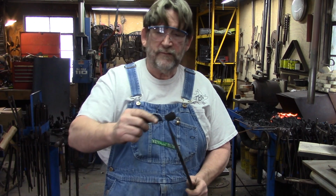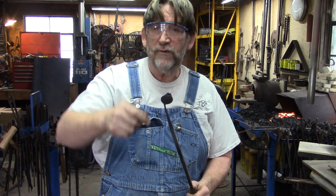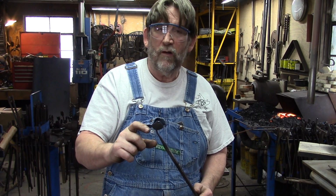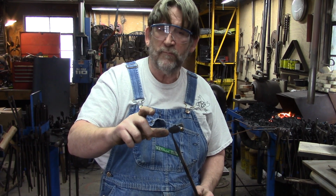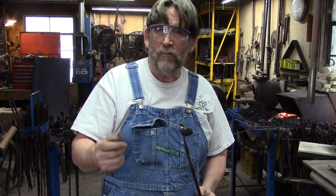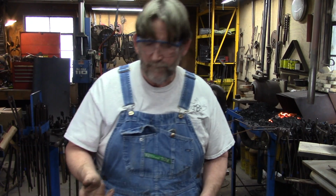Now you can take that and cut that off and then taper that stem, and you can make it into a curlicue for a keychain. A good demo for me and the public is to make about three of these. I leave the stem fairly long and try to cut them so one stem is longer than the other two. Then I bundle them together and forge weld them together to make a group of three leaves. Leaves go quick, people enjoy that demo, and if you go straight from that to welding them together, it goes fairly quick and they get to see you forge weld something together. So that makes a good demonstration.